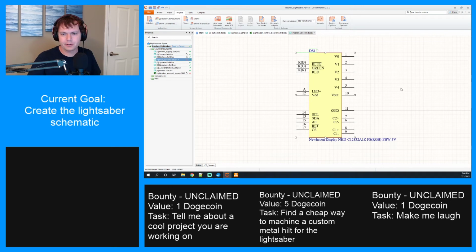I didn't even think to check the power usage on this particular board. Hold on. Let me just make sure I'm not going to burn something down. Supply current, 0.4 milliamps typical. What about the backlight? 10, 30, 30. Really, the red uses 10 milliamps, but then the green and the blue use 30 milliamps each. Odd. Very odd. Okay.